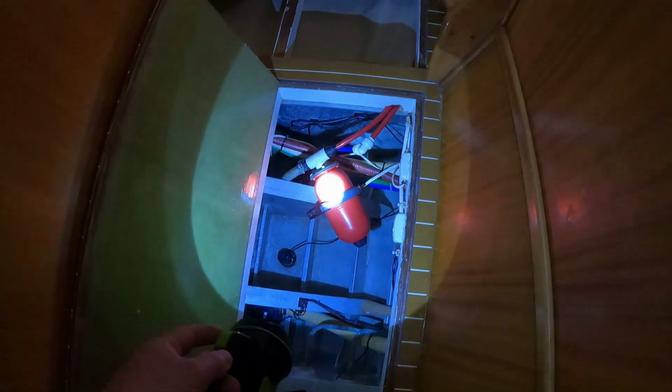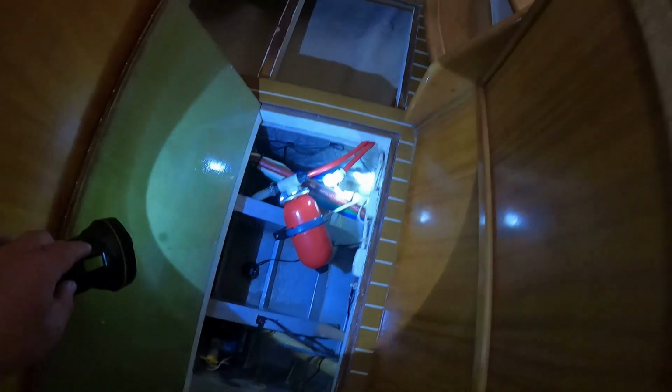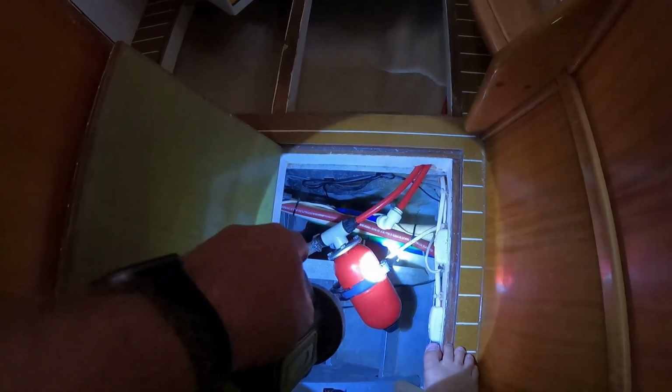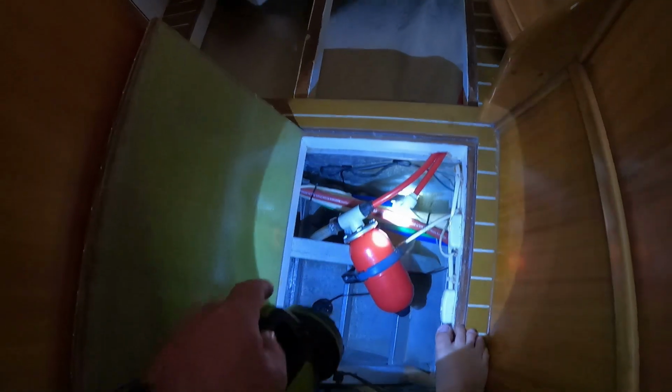I've almost completed the starboard side here. You can see that there is our spare accumulator, and the pump is located down there, and it's on a brace board just so there's no contact with the hull. There's a bit of an isolator, and I've rerun the wiring from the switchboard to come down to this pump. So it's not at the lowest point, but it is fairly level.